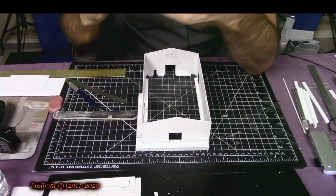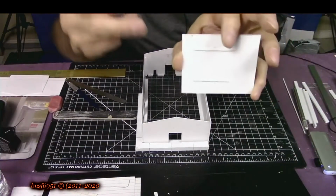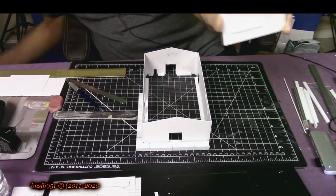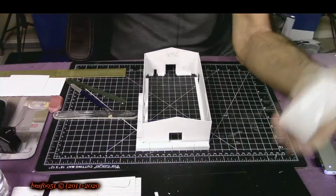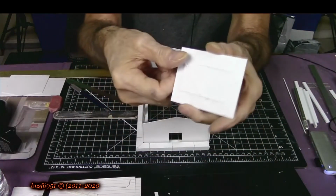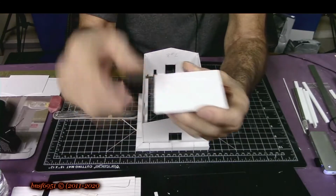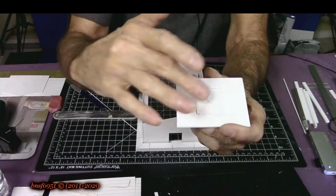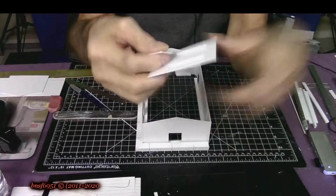Now, I'm going to cut the hole out in the door for a door opening, but I'm also going to make this a sliding door. So these here, top and bottom, are number, hold on, I don't want to give you false information. They are number 261 channel. And I cut the door to fit in the channel, thusly. Then I can have myself a sliding door. How's that? So I'm going to go ahead and cut the door opening out, mount my channels, and let's see what that's going to look like. So stay tuned, and we will be right back.